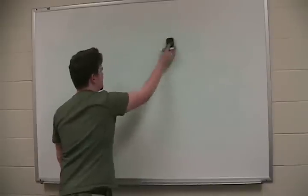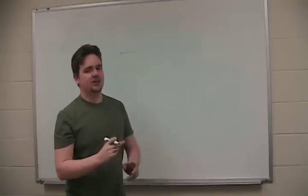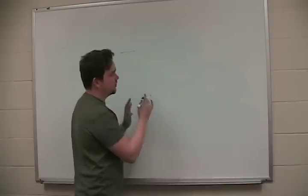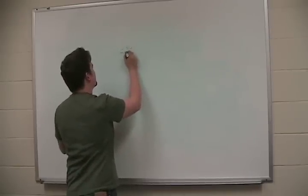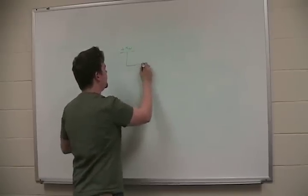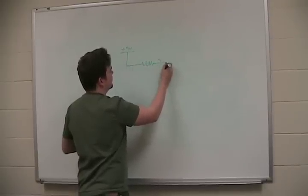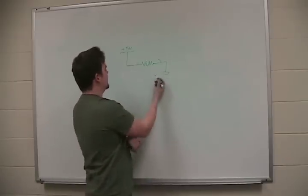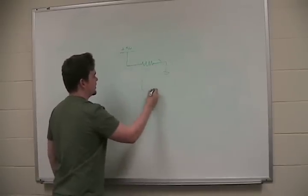So what this does is you can use it as a voltage divider. And we will use this in a lot of our stuff. This is actually what I use it for probably the most. It's really cool, very, very helpful. Say we've got a five volt source. We plug either pin 1 or 3 into our source, whatever source voltage we choose to use, and the other one to ground. So as I said, this is a voltage divider.